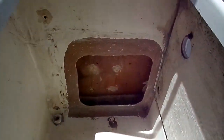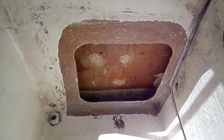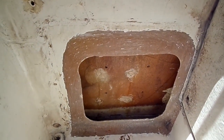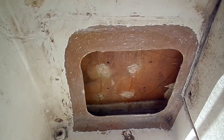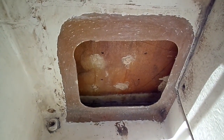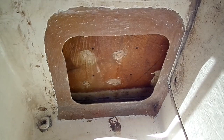I've ground out all around the spot where I'm going to put some glass. I've filled in the old holes with a bit of cardboard — I didn't have anything else to use, so hopefully that'll be alright. I did drill the balsa core before, so all those holes have been sealed up with epoxy so the water won't get in.